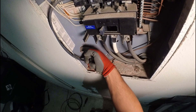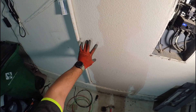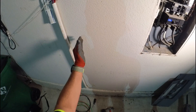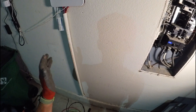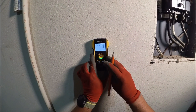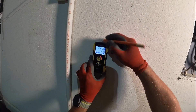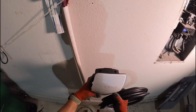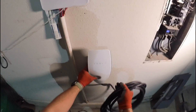We went through. Now determine the location — we know we're going to put it next to the irrigation controller, somewhere here. We need to find the stud so it will be stable and won't come off the wall if pulled hard. Using a stud finder, we locate the stud. This is the center — this is our stud. When installed, it will go this way and the cord will be here.